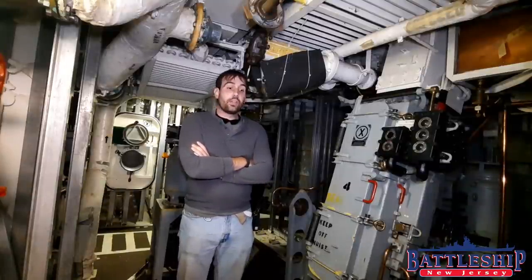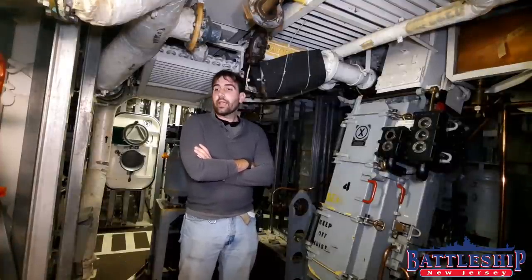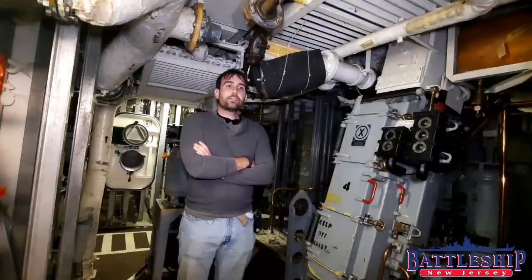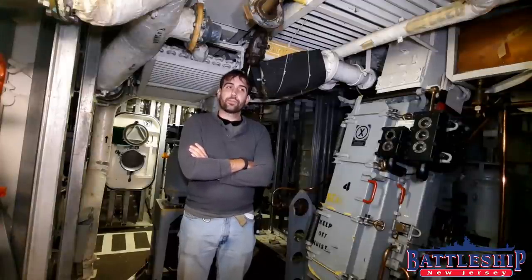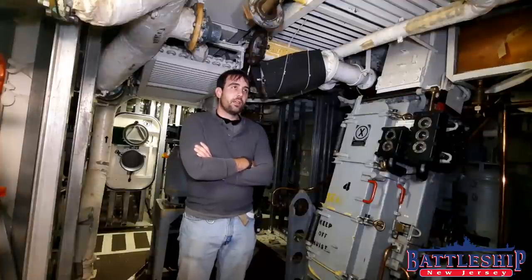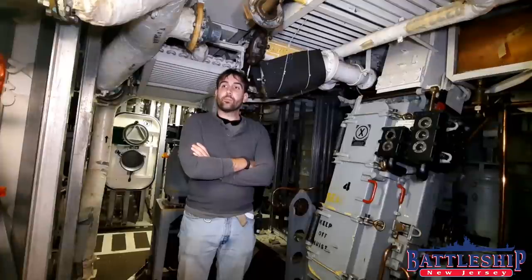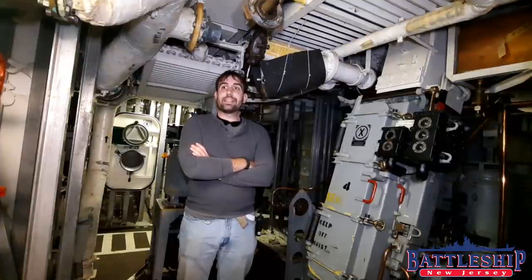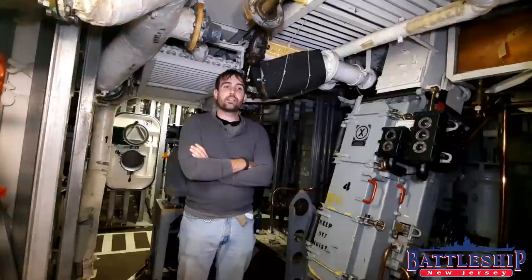Today's video, we are talking about some of the 5-inch magazines on the ship and how they work and how they changed over time. So as designed, Iowa-class battleships had 10 twin 5-inch mounts. And these mounts were fed from 6 magazines down on third deck. In the 1980s, 4 of these mounts on each side were removed in order to install missiles. In some spaces they needed the space, and in other cases, they just needed the top weight removed.